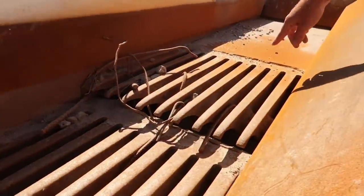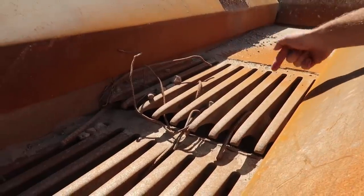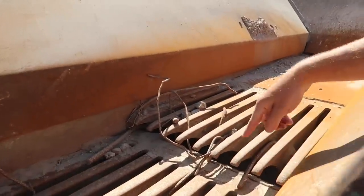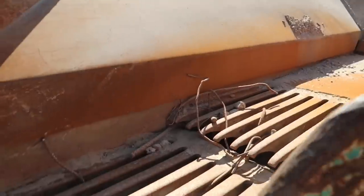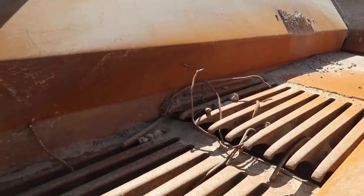The fingers, I guess. When you drop the material in, all the fines go on through there and hit the belt. This thing's shaking. Anything that'll fit between these bars will hit the belt and go on out. Y'all have to get up here and hand pick that rebar out every now and then. Yeah, before we start back, we'll get that out.